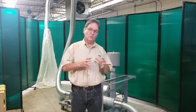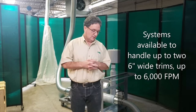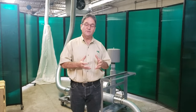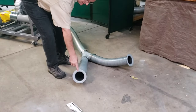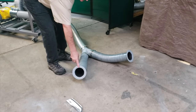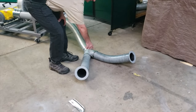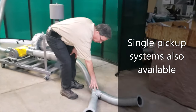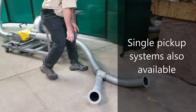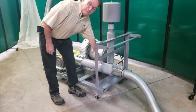This particular system is one of our largest systems. It uses our largest Venturi and a 10 horsepower blower. The largest Venturi is called the FX3 Venturi. It has a 4 inch intake, so the size where the trim comes into the system is 4 inch diameter. This duct is all 4 inch diameter. Typically people edge trim two edges, so the two edges come together and go into the Venturi — that's our FX3 Venturi.